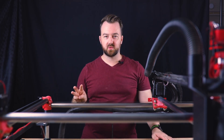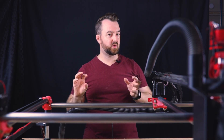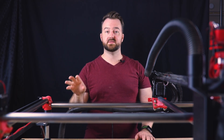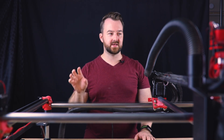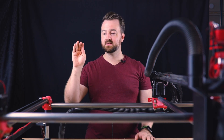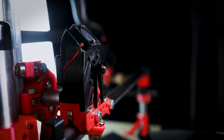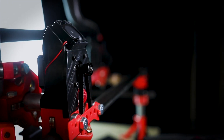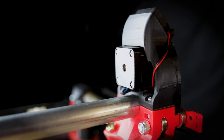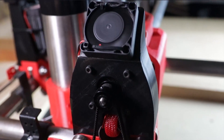This was an absolute time saver and a safety must-have so you can move around without being tethered to one spot. The third safety improvement is my upgrades to the motors. I had some issues with my motors getting quite hot and was really concerned about their long-term use. I've been pushing these at almost maximum amperage — two amps — and they've been absolutely fantastic, but the consequence was that I was overheating them slightly. So I redesigned the brackets for the motors and added a fan to the top, allowing air to pass over the motor and out the bottom.